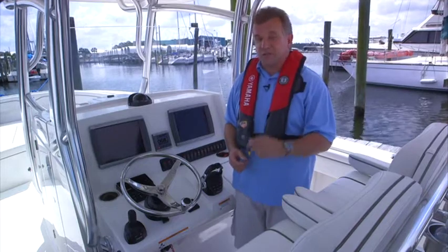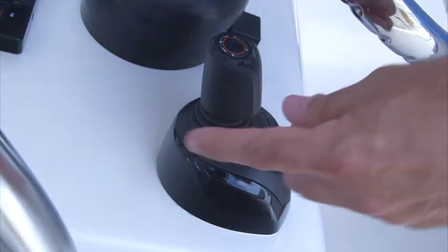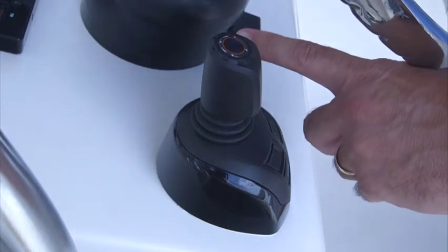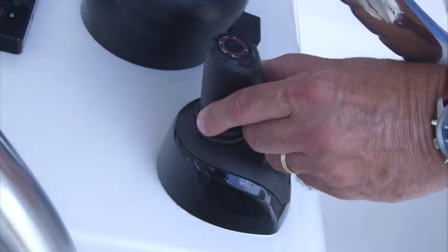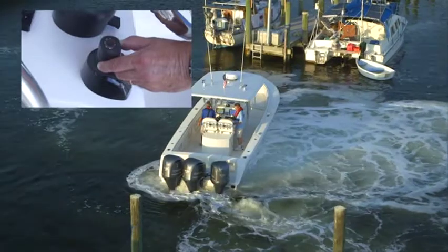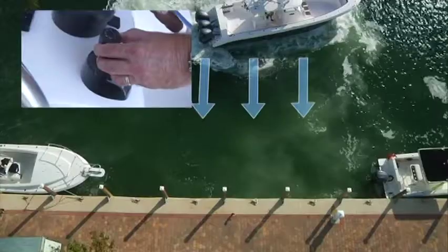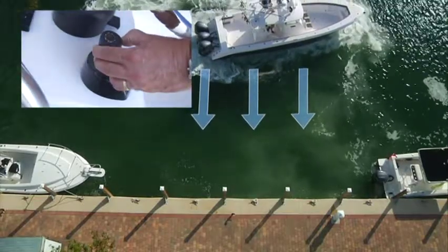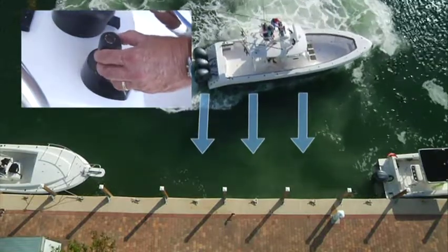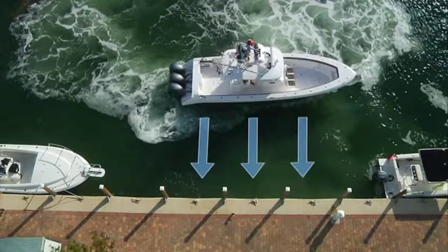Now let's try sideways operation. Facing forward, the port side of the boat is represented by the port side of the joystick, and the starboard side of the joystick represents the starboard side of the boat. To move the boat straight sideways, simply move the joystick straight sideways, using less and less movement of the stick as you get closer to your desired destination. Things such as wind, current, and even loading of the boat can negatively affect overall boat motion. This is corrected with a simple twist of the joystick while holding the sideward pressure — whether the bow is lagging or leading, a simple rotation of the stick will get your boat back on a true sideways tack.